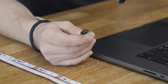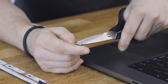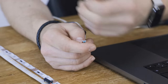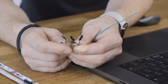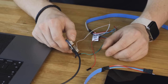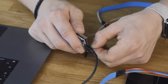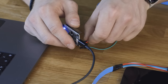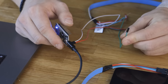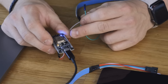Why would you want them close together? Mainly because the effects will look better the closer the LEDs are together. I'll have all this stuff linked in the description. These things may look daunting but it's really not — most people that do this will actually solder straight to the development board. But what we're gonna do is use some jumper cables as a little hack; you can basically just tear these off here and you've got a little cable which can go onto the pins of your development board. With the LED strips I've bought, they come with a little connector on the end — I'm going to say bye-bye to that, bare all of these wires, and connect our jumper cables to them.